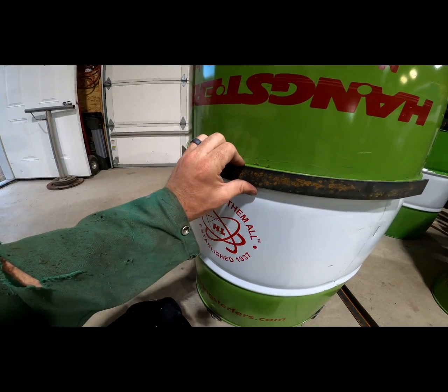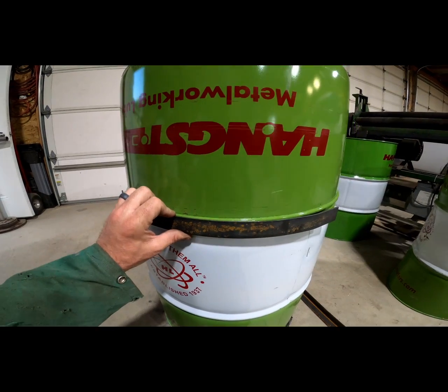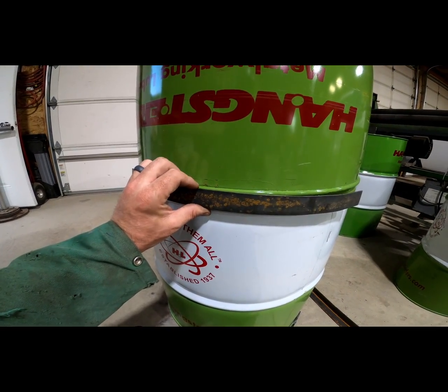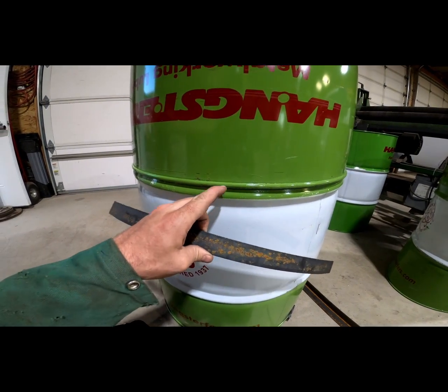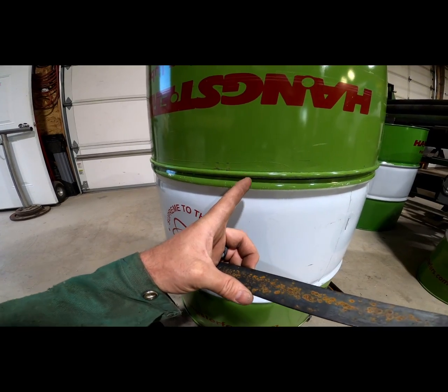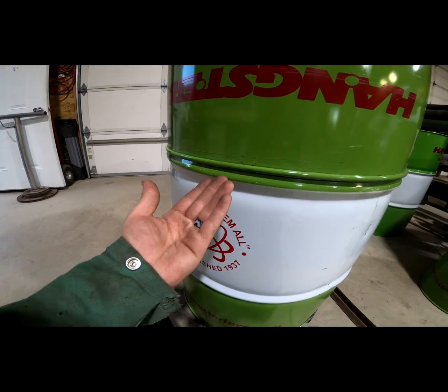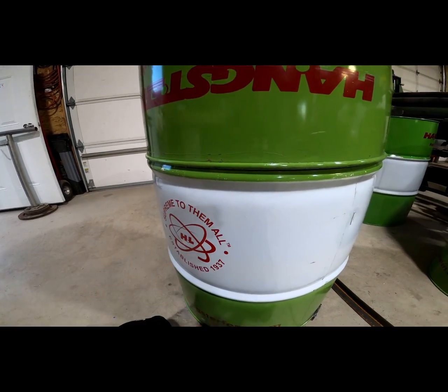I'm essentially going to buy 2-inch of this, and I'm going to roll it a full ring. I'm going to weld it onto that lip. So as I put this down over this barrel, it helps line up on this little groove, because it's pretty much just a chamfer going into a chamfer, or this bead going into the top of that drum essentially.